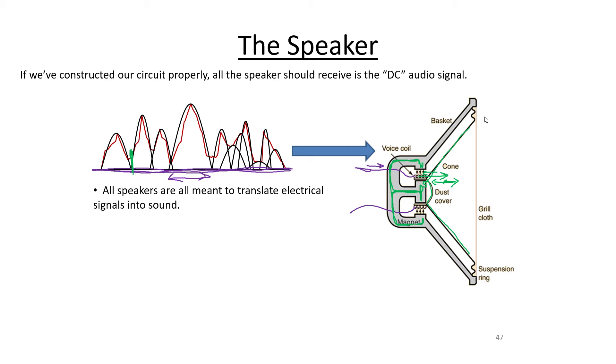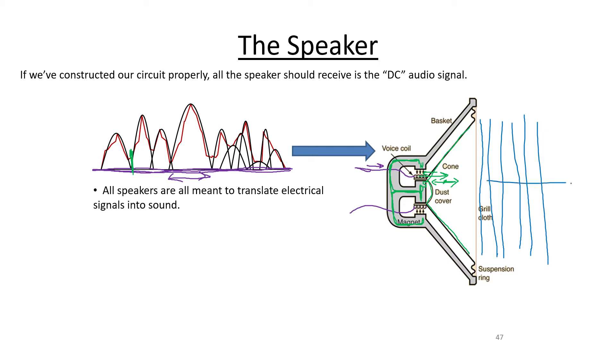This oscillation of the membrane sets up a pressure wave — which is all a sound wave really is — that propagates out from the cone of the speaker. Sound is a longitudinal wave; it goes out until it hits our ear and gets translated again into an electrical signal sent to our brain. So the basic process is: current creates a magnetic field in the tiny voice coil, which interacts with the permanent magnet's fixed field, causing mechanical motion of the cone, which produces a sound wave. That's how it's done, front to back, in our radio receiver.